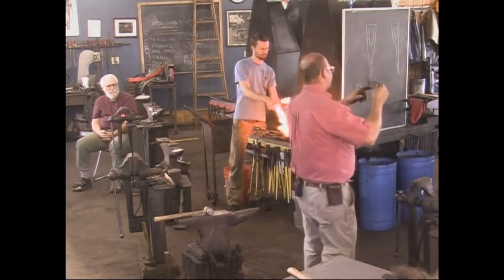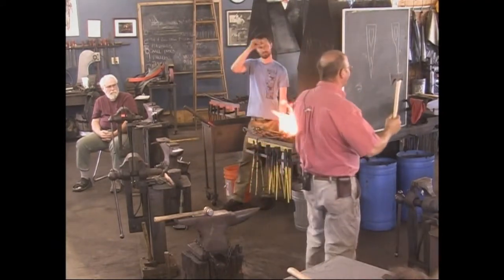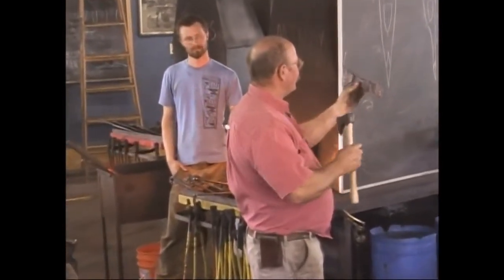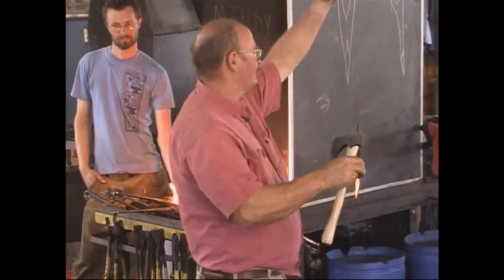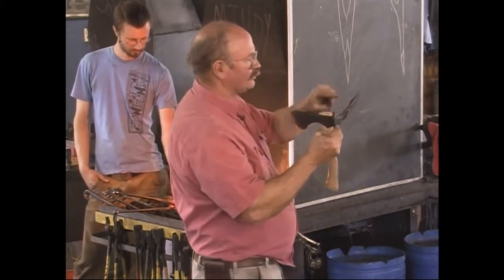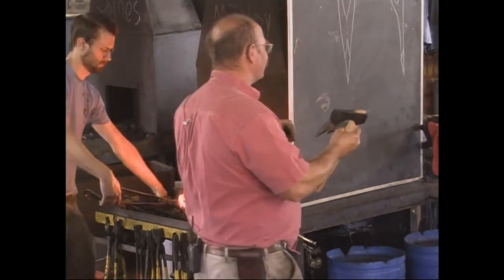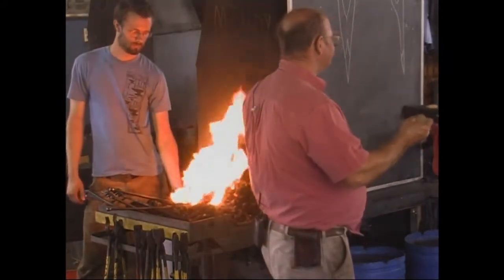This one's only got one ear — that's this axe. I like the straighter top. To try and forge it this way means that you have to thin this eye in the other direction and that makes the axe head curl over. I forge the ears exactly the same way to get this and then cut it off. I've never been able to peen anything all to one side — it's probably possible, but I've never pulled it off. So I think it's easier to just take a hot cut and cut that extra ear off.